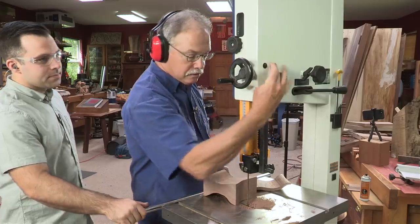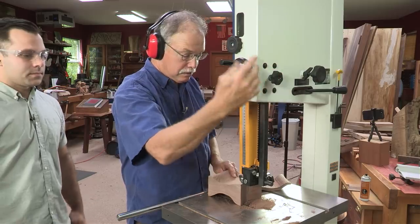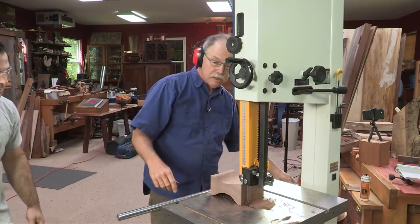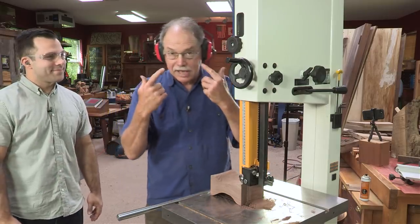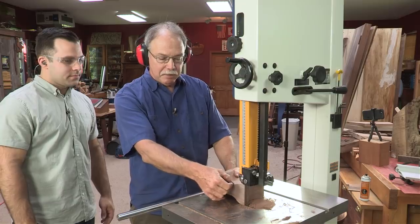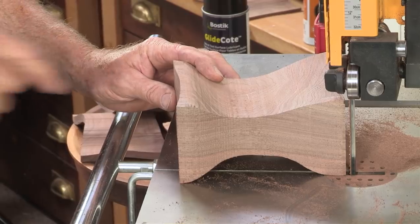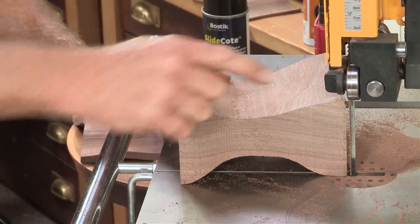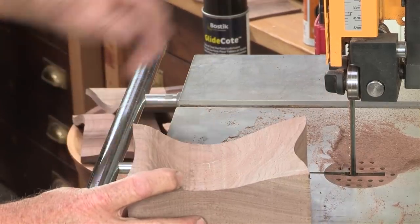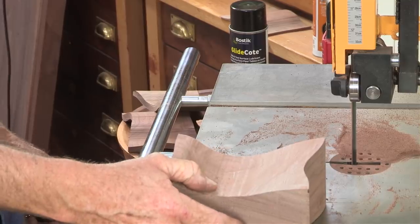With the bandsaw off, whatever you do, make sure you always read, understand, and follow all the instructions that come with the tools and products you use in your woodshop. Work safely — we have safety glasses and hearing protection on. Now we're going to do a free-form cut. I haven't laid out any lines; I'll start the cut and then I want you to duplicate it and come back over to our entry cut. Look at how I have my hands positioned — they're down to the table. You never start the bandsaw with a piece of wood touching it.